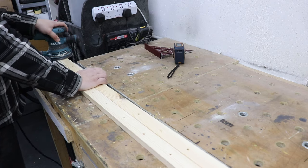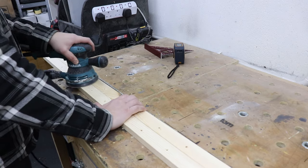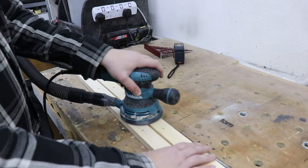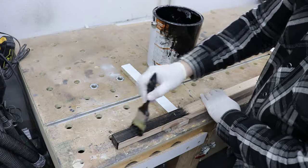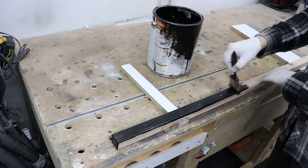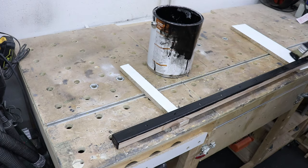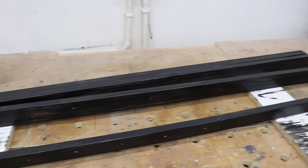With that done we can head over to a bit of sanding. Don't go too mad with it — I'm going with grit of about 100 and I'm going to break the edges on all the boards so there won't be any splintering. After that it all depends on you. You can put this together as is, or you can apply some finish or a protective coating. I, for example, am going to apply a wood sealer — a black one — so it matches my raised beds.